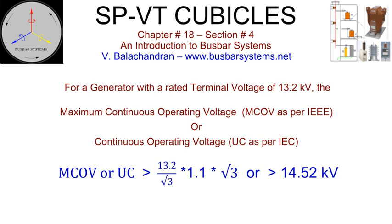When a lightning arrestor absorbs the surge energy, it gets converted to heat, and pressure starts building inside the housing. Once the pressure exceeds the threshold value, it is released through the vents and external arc inception may occur. Under these conditions, the arrestor must be replaced. The surge energy absorbing capability is measured by a parameter that is assigned to the arrestor in terms of kilojoules per kilovolt. It is proportional to the discharge current capability of the arrestor. A station-class surge arrestor with a 20 kA discharge current will have a higher value of kilojoules per kilovolt than one rated for a 10 kA discharge current. The higher the energy absorbing capability, the lower will be the probability of the arrestor's failure.